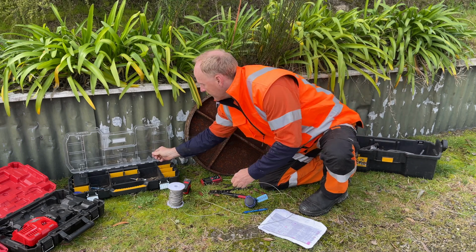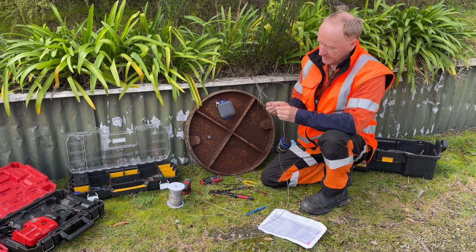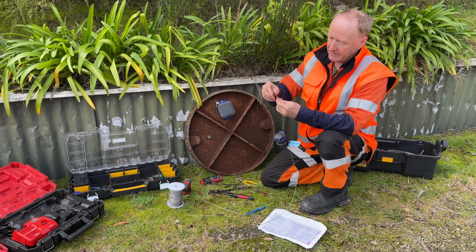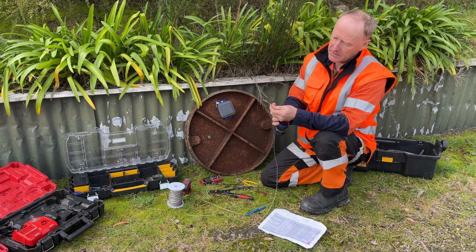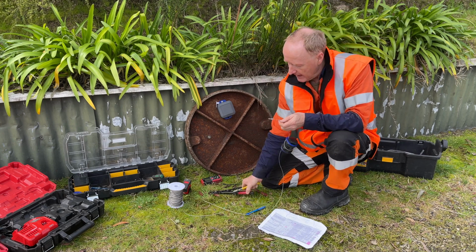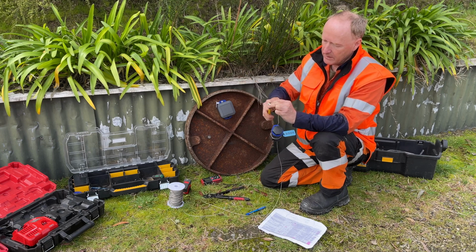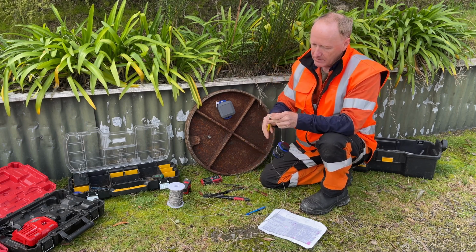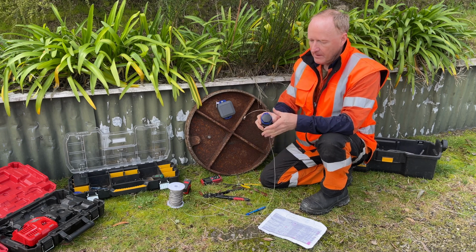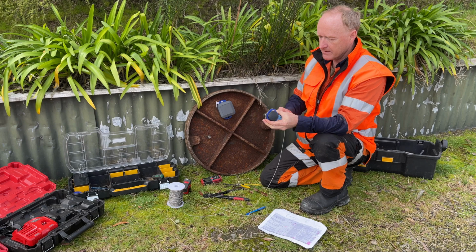And then on this one I will do it with an alternative tool in case you don't have the cable crimper. So at the end we just run a small loop around, circle like this. If you don't have a proper cable crimper, this will work absolutely fine. All you do is put in 3 nice strikes, and this will do a similar job to the cable crimper. And all you do is run the loop back nice and tight, like so.